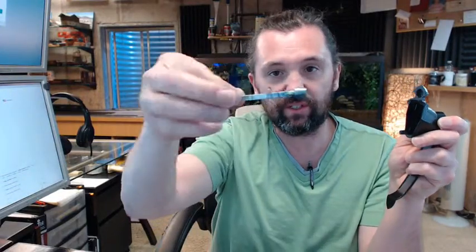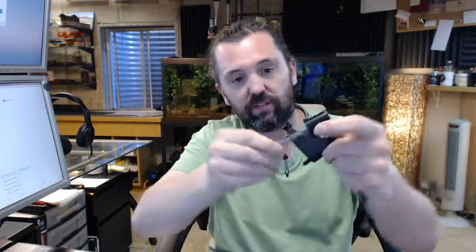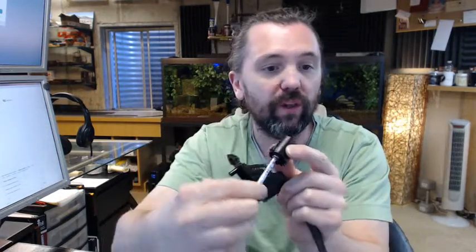Be careful of that knob. You don't want it to fall out. This is the spindle that seats inside of there. It can only go really one way. You're going to have to cut this tail piece down. Most likely you will. Don't try to snap it off or break it. Just cut it carefully, because the spindle must project through the door between 3/16 and 5/16 of an inch. If it's too long, cut it down.